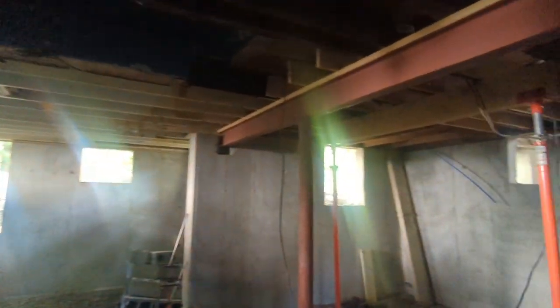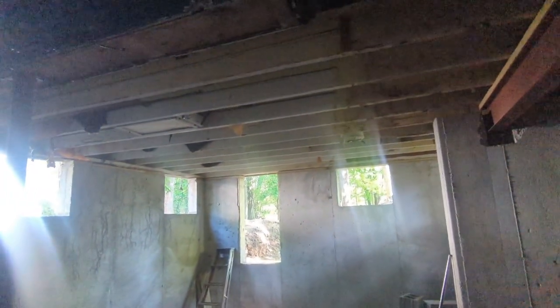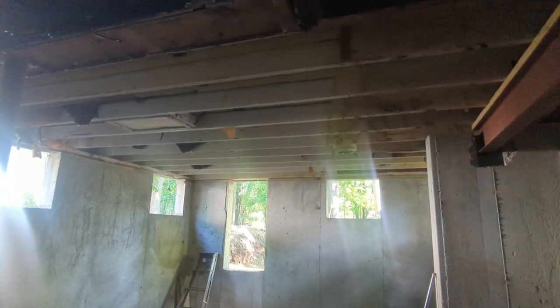But I think we're going to sister all of these floor joists because it's 15 feet anyway, and doing that with a 2x8 just makes for a spongy floor. So we're going to end up getting a bunch of those anyway delivered. And I found where I can get a glulam that I can cut two 7 1/4s out of, because the 7 1/4 glulam, or LVL, laminated veneer lumber, which is how we're going to build the beam the architect wants here, is a really small size.